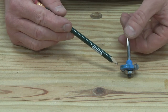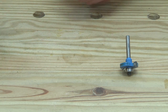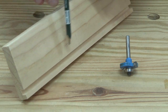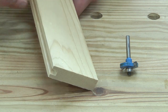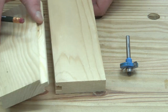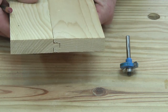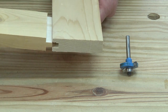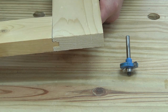Next up is the quarter-inch slot cutting bit. This bit can actually do several things. Just like that spiral up-cut bit in the other video, it can make a groove for you all the way down it. But it can also do things such as putting a groove down the edge grain, and you can also then, with the same bit, make a tongue to go in it to give you like some plank flooring. If you make the tongue on some end grain, you can make a groove with a mini tenon. So a very functional bit — I'll show you the setup for that.